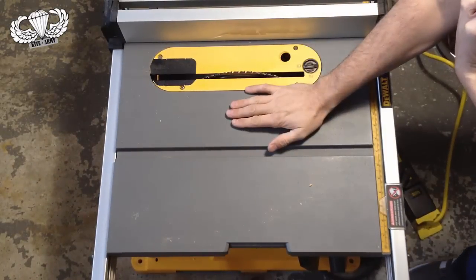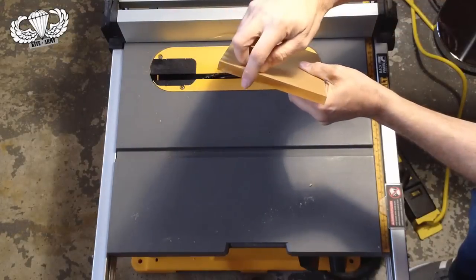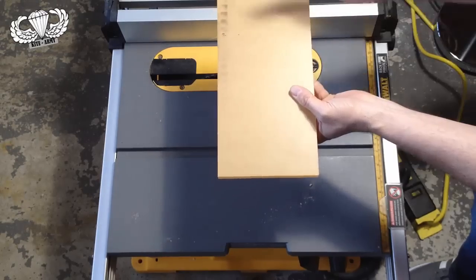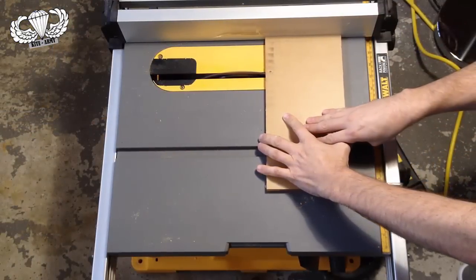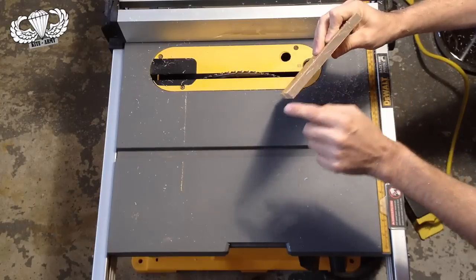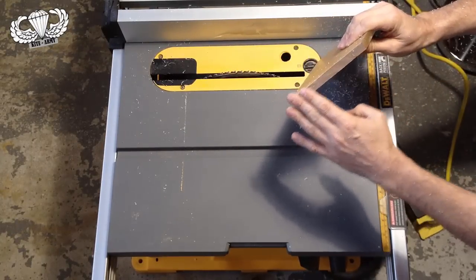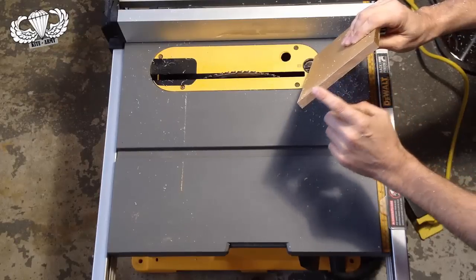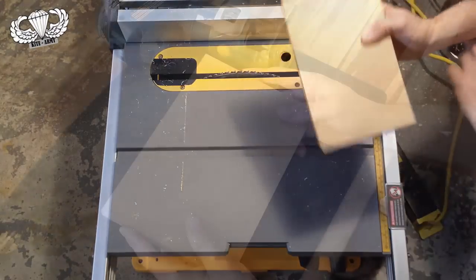The first cut I need to make on my standard circular saw is right here on the half-inch thick plexiglass — I need my dimension to be nine inches long, so that'll cut the extra piece off. That cut came out well. You can see it's a little scraped up because the blade heated up and melted the material, but you can fix this. You can wet-dry sand it with really fine grade sandpaper, then put a hot torch over it really quickly and it'll become clear again, just like this surface.